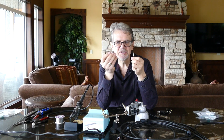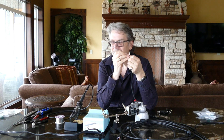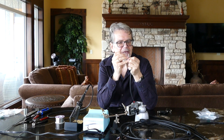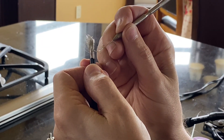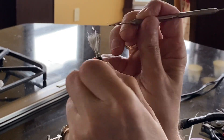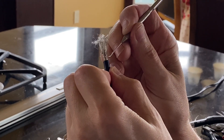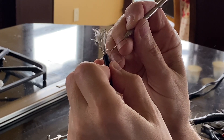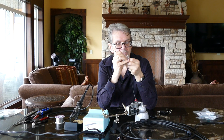Unbraiding is a little bit of work — you need a very small, sharp tool. I actually have some old dental tools from my dentist that I've had for about 20 years, but any kind of sharp pick will work. You just go all the way around the cable, picking from the exposed end first, trying to pull those little braids out. This is a tedious step, but don't rush it because you don't want the wires to break as they pull against each other while unbraiding. You'll also notice that inside the Canare cable, instead of nylon filler, they have a cotton fiber rope, so you may see fuzz and fluff coming out as you unbraid.